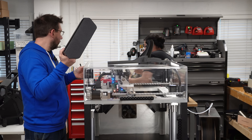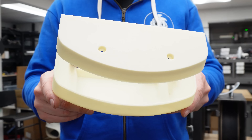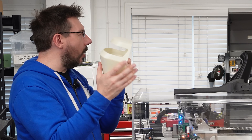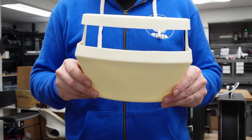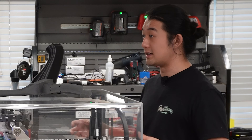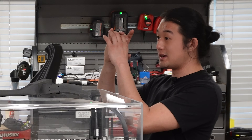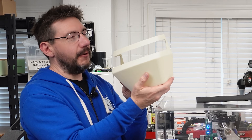Last of all, we have our glass fiber nylon. It has similar mechanical properties to a base nylon, but the glass fiber really helps with internal stress and wear resistance. Glass fiber parts always feel solid, and the finish is fantastic. We use glass fiber sometimes for aesthetic parts needing good resistance and strength, but with more flexibility than carbon reinforcements. It's also great for gear trains — we built an electric skateboard with gear-driven wheels putting three kilowatts through printed glass fiber nylon gears. I did two to three thousand miles on it over a summer.